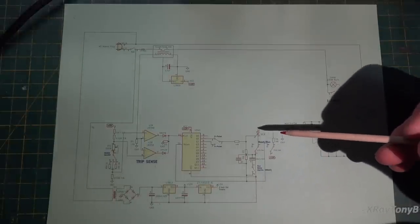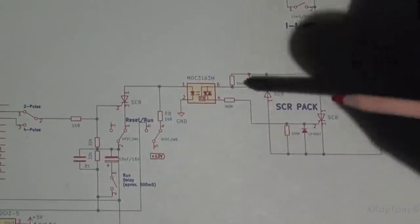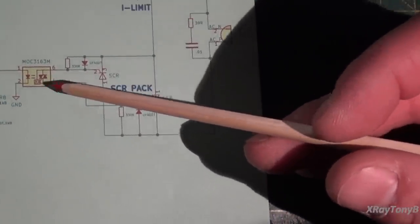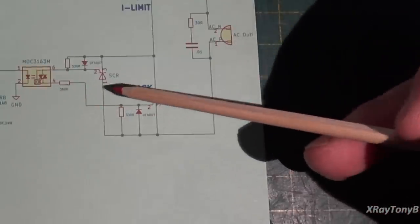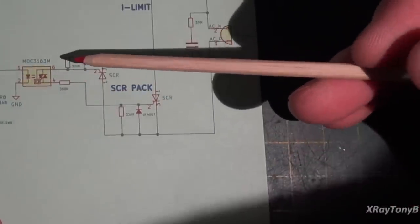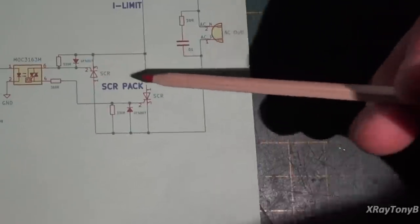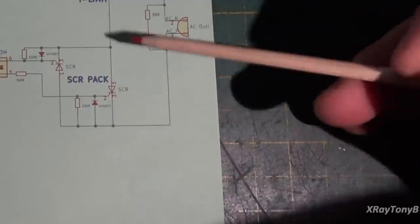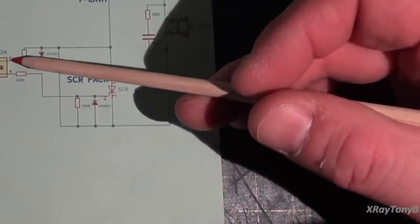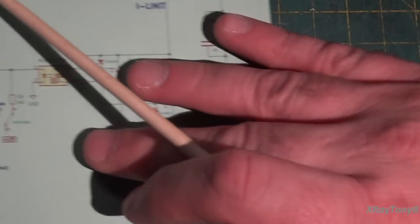What I decided to do was rework this whole circuit and use some discrete components. One advantage of this opto-isolator with zero-cross-detecting circuitry is that it has the option to drive a single-element gate such as a triac, which has only a single gate, or a dual-element gate — two discrete thyristors or SCRs each with their own gate. So you notice there are two pins coming out, each one driving an individual gate.